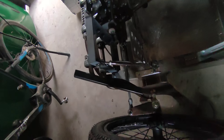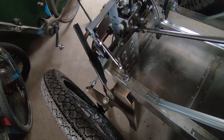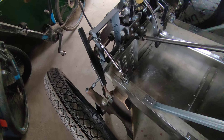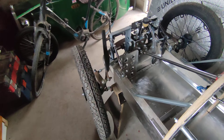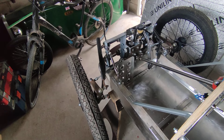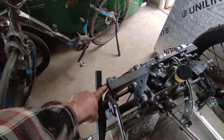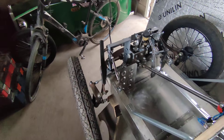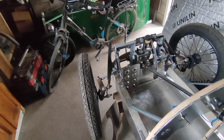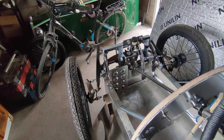That will stiffen the spring in this part of the member, and I'll do that on all four of them, grind them off, make them look a bit pretty, and paint them up silver. I think that will solve any visual issues I have with it altering camber around bends. It might still do it a little bit, but it held the track well enough even with the spring. My little concern is it might turn into a stress multiplier at this point, but I'm willing to give it a go. I think that'll be enough to make it a good suspension system from an adequate one. The bounce and spring rate were great — it didn't need damping.